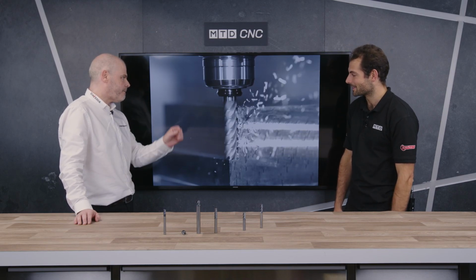Yeah, absolutely. And it's because we've got this very low AE and high AP with the chip split that we can maintain those high feeds, which is great for things like trochoidal milling.